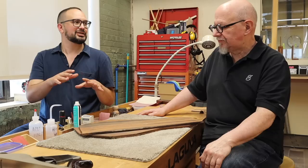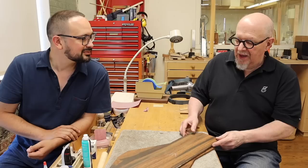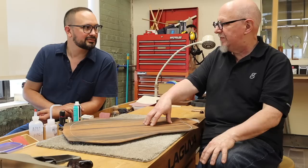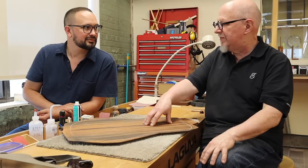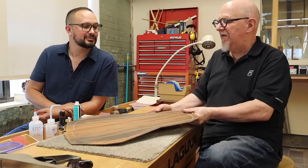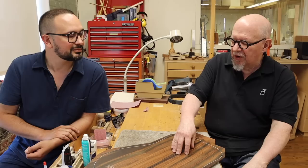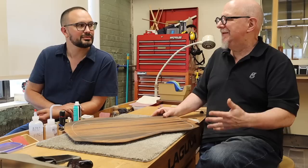What attributes make Brazilian rosewood so valuable and desirable? These days, it's its preciousness, which is why it's desirable to the market. I don't really look at wood as a species — when I look at a piece of wood, I'm thinking about a set of mechanical properties. I have sets of rosewood with the density of ebony or African blackwood, and sets with the density of koa. It's all Brazilian rosewood, but it will make a different sounding guitar — not better or worse, just different. The density of the wood affects the overtone series of the guitar.